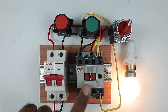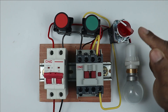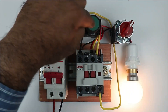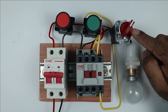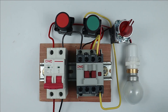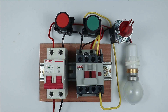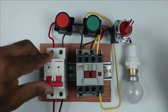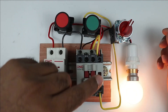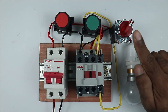To turn off this contactor, I have to press the stop push button. So using this same selector switch, this contactor can be made as inching type or non-inching type. Now at the selector switch, an indication is provided. Let's understand how the wiring of this indication can be done and in which condition it must glow. I want this contactor to be used as holding type — meaning on pressing the push button, the contactor must remain on, and on pressing stop, it turns off. At this time, the indication lamp must glow.